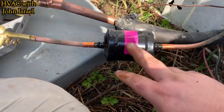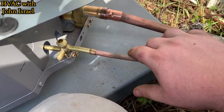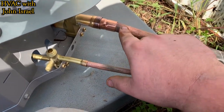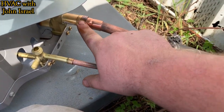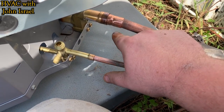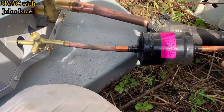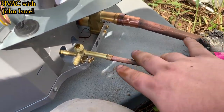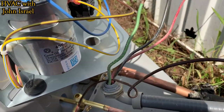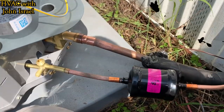We have our lines fitted up and our dryer. For some reason ICP likes to use a 7/8 valve even on three tons, so rather than stick the three-quarter suction line into the valve and pinch it, we're using a bushing — a reducing fitting, bushing fitting, whatever you want to call it. Dryer's going in very nice. Everything's nice and neat. Now we'll braze this and hook up the whip along with the low voltage. We're in the home stretch.